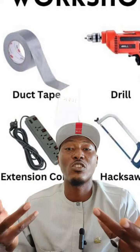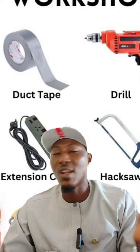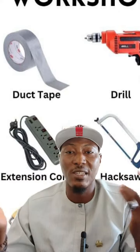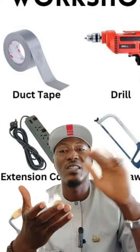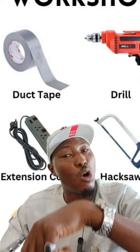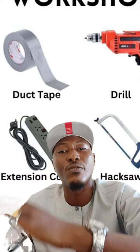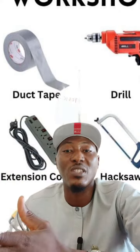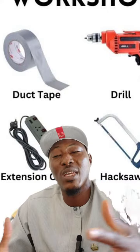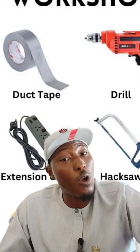But if you try this during the daytime when the machine has already worked, for instance, it has traveled and there is sun and all these things, there is potential vaporization, which will not give you the actual level of that engine oil. So that's why engine oil is best tested in the morning, so that once you remove the dipstick, you can see the level of the engine oil, and you can deduce if you need to top it up or if it is properly gauged. Also, all these things put together can help you extend the lifespan of your machines, and also prevent you from costly repairs.